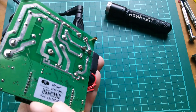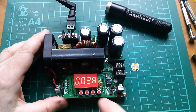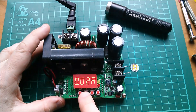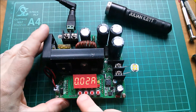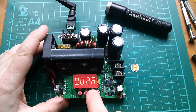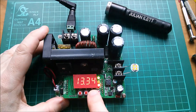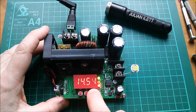Connecting it onto the BST900 - 900 watts supposedly maximum power. I've set it for 12 volts as a starting voltage and 20 milliamps again. On this one the current goes up in 10 milliamp increments; on the other one it goes up in 1 milliamp increments, so it's a fairly coarse scale. Let's start winding the voltage up. And this thing goes all the way up to 120 volts DC.